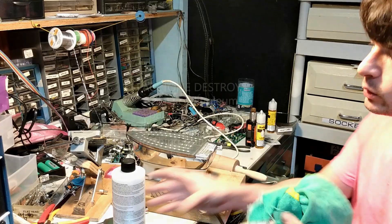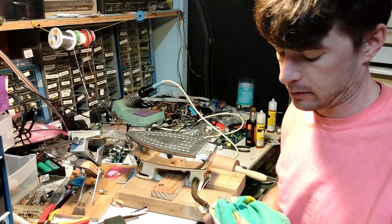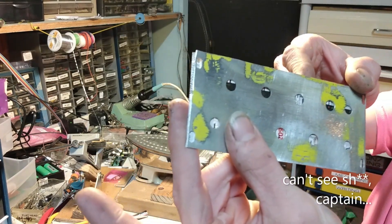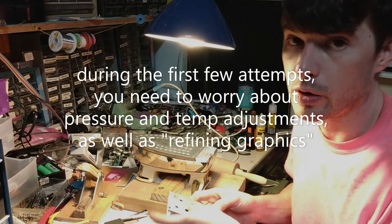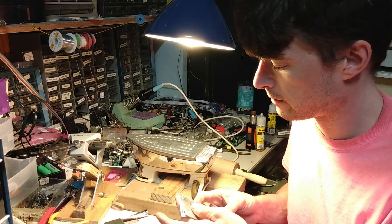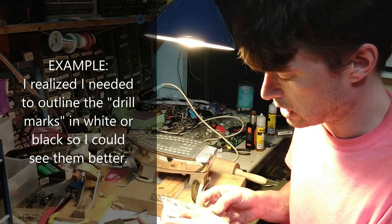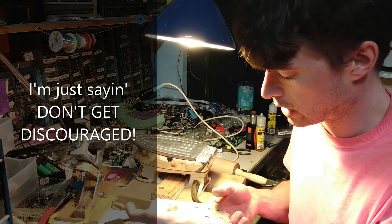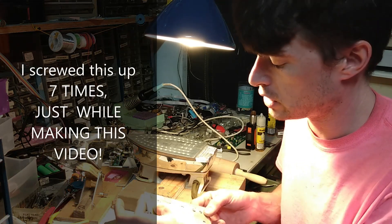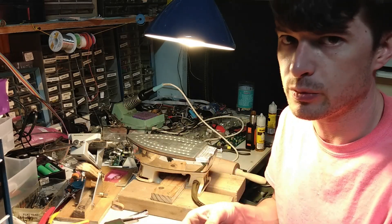Be careful with your acetone — it's like acid for anything remotely plastic and will destroy everything. This is the hardest part. You will likely screw it up the first time, so be prepared for that. This takes some practice. If you make a mistake, just wait for it to cool, grab a rag, and wipe it back off with some more acetone.